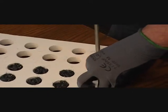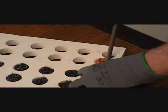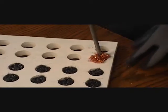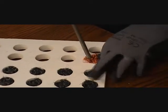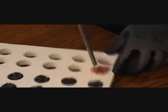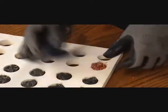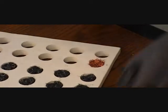1 inch of Xcluder? The answer is that Xcluder's combination of stainless steel wool and polyfibers provides spring back, locking Xcluder permanently in the hole. Copper mesh doesn't have the same spring back. Testing has shown that it takes almost twice as much force to dislodge Xcluder from this type of hole as it does copper mesh. There, now for the other 9 holes.